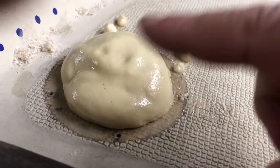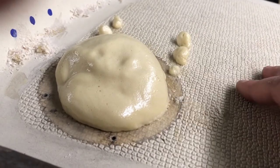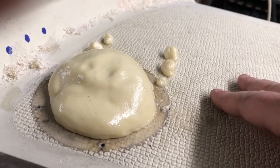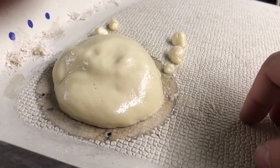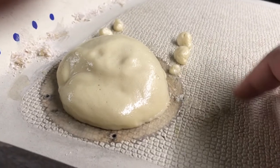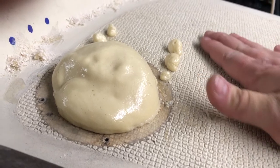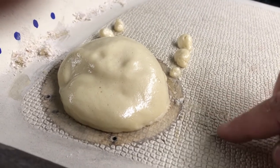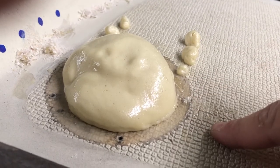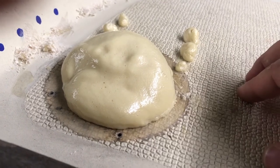My other plan was to cut this all out completely and then fill it with plywood or like a PVC board that wouldn't rot, and then epoxy it all in there a few times and then put the top back on. And then I would have to fiberglass all this out here to make it look good. With this, it shouldn't be bad. I can just go ahead once this all dries and cut this all flush to the top, and then fill this part in with some fairing compound and get this nice and smooth here, and then paint it and mount the clutch.